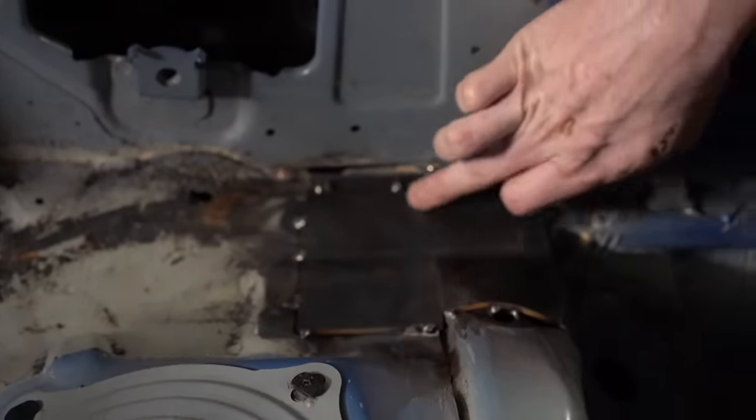The last measurement I need is the base plate to the roof. This car specifically is the only one that I've ever had to do differently because it is super hard to get the main hoop to touch the roof and have the backstays have enough room to get to the plate here, because there's a bulkhead here that interferes with that tube completely. So the main hoop actually has to be slightly lower than the roof and then positioned underneath this bulkhead here. This is a 350Z specific problem.